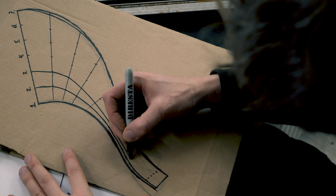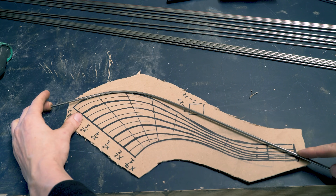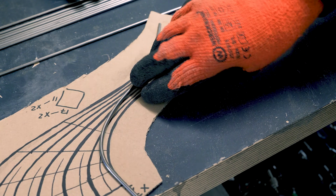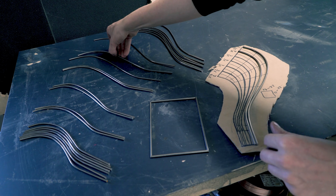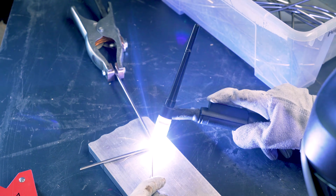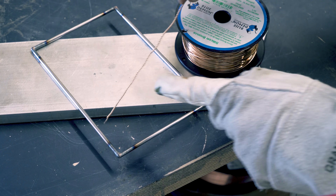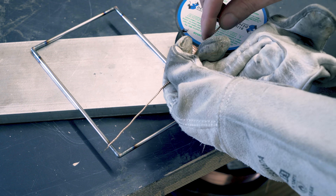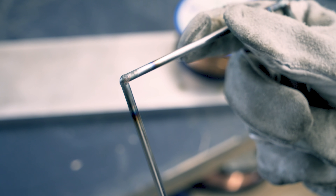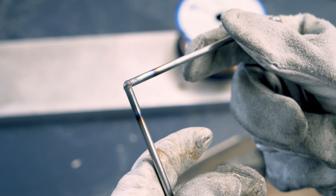With a two-dimensional sketch of the cyber funnel, I could bend all the metal wires and fit them to the sketch, and then I could start to put the funnel together. I'm using silicon bronze TIG brazing for this work, and it's wonderful to work with. It has a lower melting point than the steel, which means the steel doesn't disappear — you can glue the steel together, so to speak, and you can easily control the result.